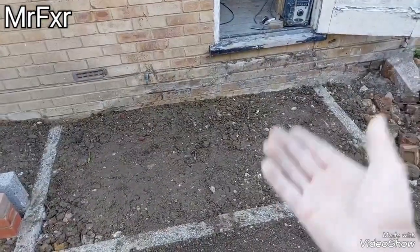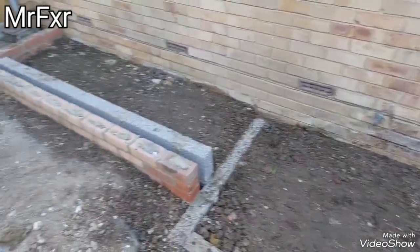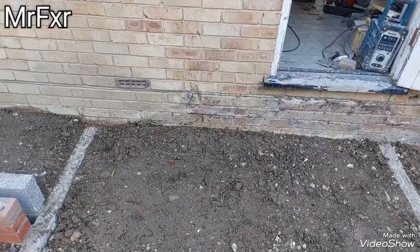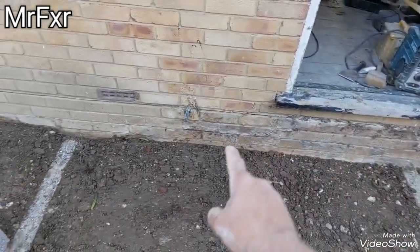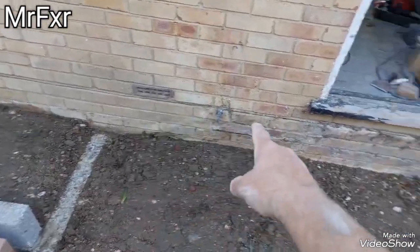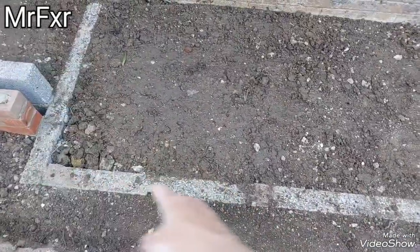for radon gas, and it also stops any rising damp into the void, sort of minimizes the amount of dampness under the floor. So I'm just gonna put sheeting on, shutter it, and put rebars on that side. I'm gonna drill them in, and I'm gonna set them into the wall, and here they're just gonna be suspended off them concrete blocks